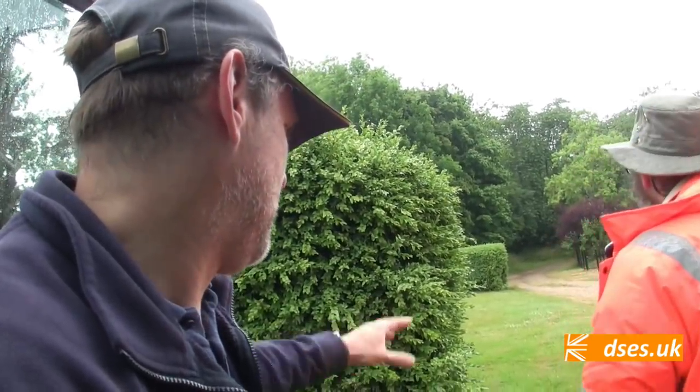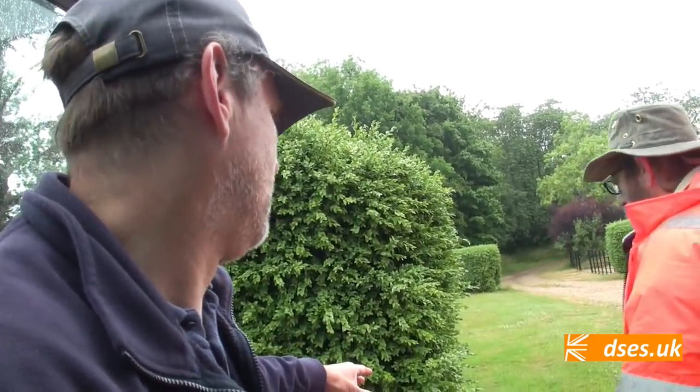I haven't thought about it at all yet. But obviously we've got a feed here. This is all based on a 40 amp feed. The whole house is only 100 amps, so 40 amps isn't based on demand. It's just based on giving them a fat feed out to the outbuilding so they can do whatever they want with it in the future. They won't be using anything like that for their demand. But here we will have to break into it and put something in.